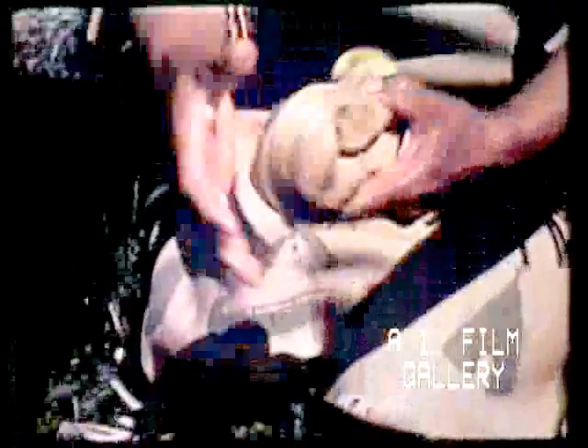First, the lumps of raw gum are placed in a bag and boiled in water. The bits of bark and dirt that cling to the gum are held in the bag, but the clear gum rises to the surface and is skimmed off with a birch bark spoon. The hot liquid gum is dropped into cold water and hardens immediately, and is pulled until every drop of water is gone and it turns the colour of wild honey. Again it is boiled over the fire, and this time tallow is added — exactly the right amount to make the gum soft enough not to crack in cold water, and yet hard enough not to melt in the hot sun.